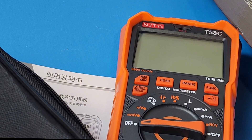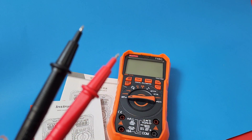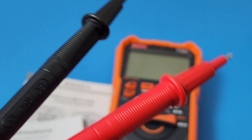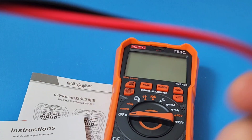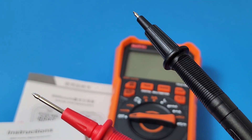Probably more complete than a lot of multimeters, just because it does inductance as well. Almost missed this — our certificate of authenticity. September 2024 was the fab date, so you've got the real NJTY McCoy. These test leads are very, very nice and not your standard OEM. Very high end — as high end as you're going to get in the cheaper realm. A lot of body to them, and they have that nice protector on top. Remove that and you lose a CAT rating, but you gain extra space for test measurements. Very pointy, sharp, and nice and long. Extremely high quality PVC.